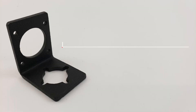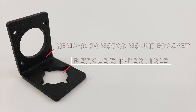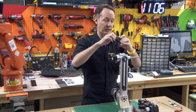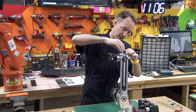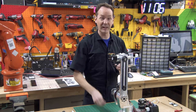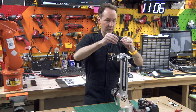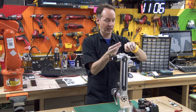You're going to need the NEMA 11 J4 motor mount bracket. You'll notice that one side of it has what looks like a reticle for an elite sniper rifle, and the other side just has the circle. The circle side goes to the machine. Now I'm going to put my screw through — I'm going to put all four screws through. When you're dealing with a washer stack they're going to want to move around, especially nylon washers. So I'm just going to put all four screws through, and make sure you have this facing the right direction — the star target headed that way.